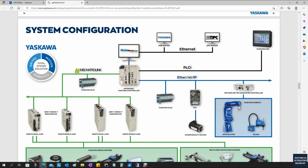As we know, in most cases when we implement motion controllers, the safety functions STO, SLS, and SS1 are quite essential and significant functions we need to build into our machine system. However, this controller does not come with the safety built-in function. We definitely need to use a safety controller and safety relays to implement the safety control.